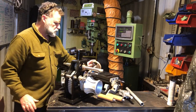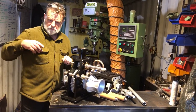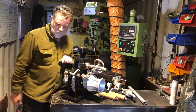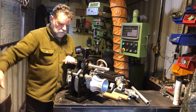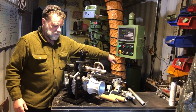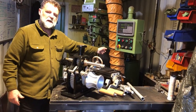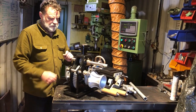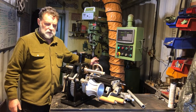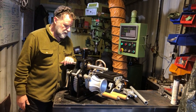What you can do with one of these windlasses: with the brake off, drag some chain out over the gypsy, take the pin or unlash the anchor, and have the anchor hanging out through the bow roller over the water. You can cleat off a line aft, take it over the top of the warping drum with a couple of turns, and lead it all the way back to the cockpit. Put some tension on it, then take the pull off, and from the cockpit by easing the tension on that line you can deploy the anchor. So if you're sailing into an anchorage by yourself, you can use that technique.